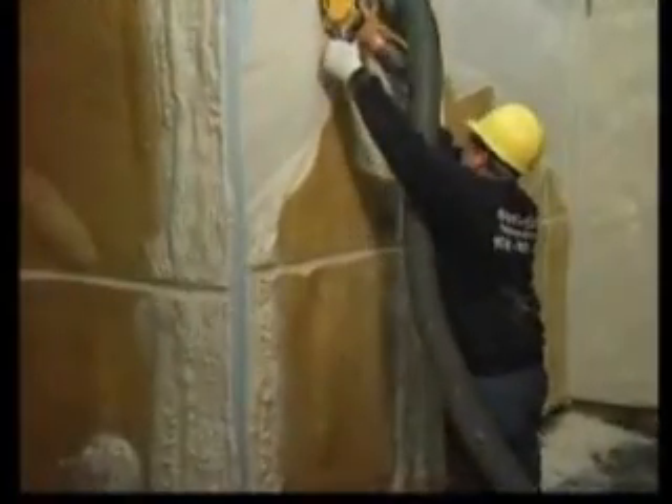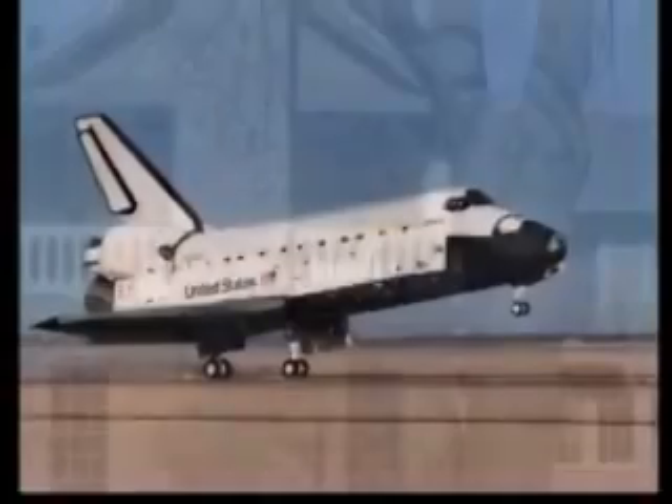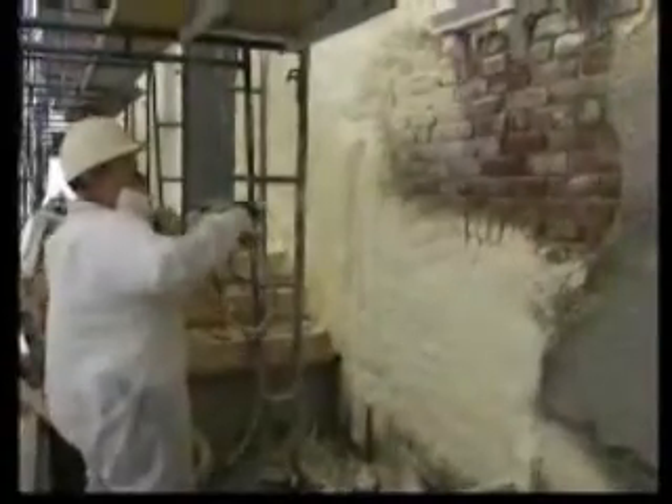Masterbond SP uses the same tried-and-true insulation that has been used in refrigerators, freezers, boats, and even the space shuttle. The new spray foams have a zero ozone depleting potential, and they will not shrink or sag over time. With incredible bonding properties and insulation values between R6 and R7 per inch depending on the application, the foam is sprayed on the exterior surface of a building using a pressurized spray gun system. The foam expands to fill any larger gaps and bridges over smaller cracks and holes.